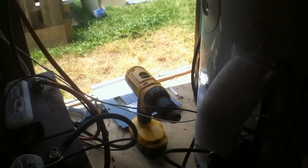So guys, here's the final look at the water heater as far as that goes. You can see right here the wires coming in, the hot and the ground is just passing directly through back to the battery. Where that's coming in right here is just right there, so the customer can just flick the switch on or off if they want the water heater to heat up. And the rest of the time during the daytime when it's dumping, the dump load will go direct to it, and they can set their thermostat on it how they want. And then if it's nighttime and they need to heat their water, then they can flick it on.